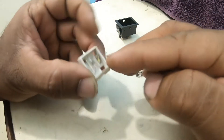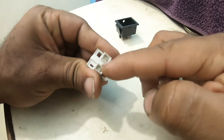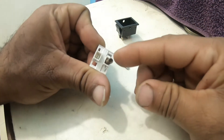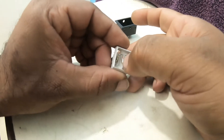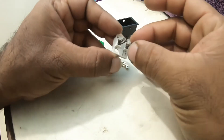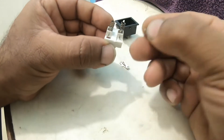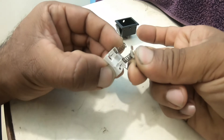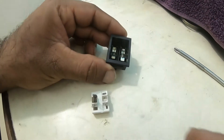Inside, I found a small filament bulb with a 100k resistor, coupled together in brackets. The spring makes contact with the terminals of the bulb — one terminal goes directly to the spring, and the other goes through the 100k resistor to the spring. This is the contact patch, and it assembles on top like this.